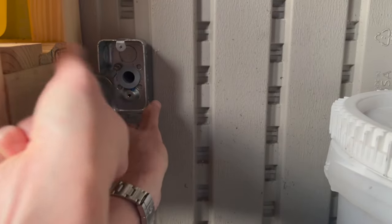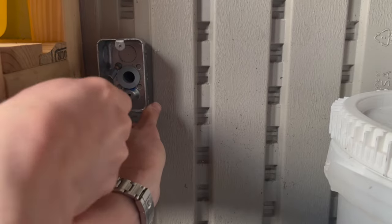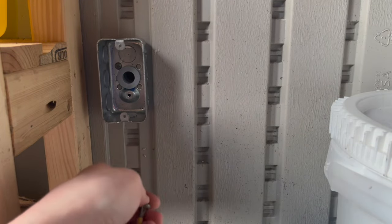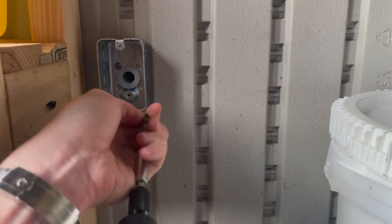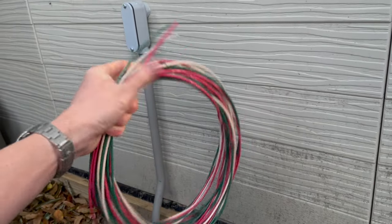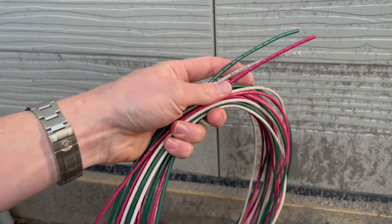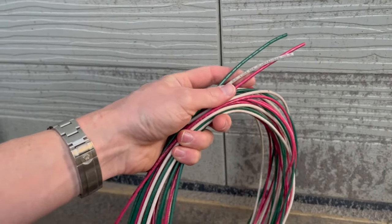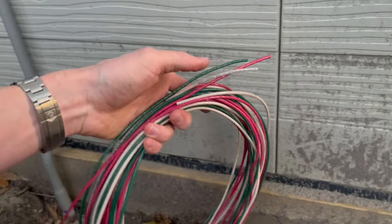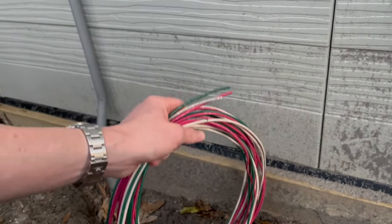I didn't even drill a hole into the wall here — I'm just using the screw to tap itself in. This is the wire I'm going to be using to run underground over to our outlet box. It's weather resistant THHN, fine to use in conduit underground. This is 12 gauge because this will be going back to a 20 amp breaker, so you want to be sure you're using the proper gauge for the breaker that's in your panel.